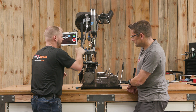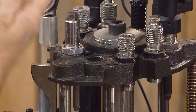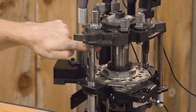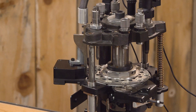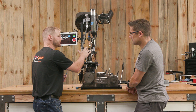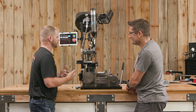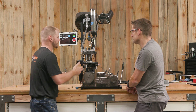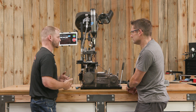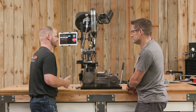So I'm going to run the pin down just a hair — a little goes a long way — about a half turn. This pin pushes on the rocker, actuating the priming: the pin attaches to the tool head, the tool head comes down, the pin goes through the shell plate, hits the rocker, the rocker rocks, pushes the primer punch up, and seats the primer. The reason you don't want to go too far is you don't want to shove a primer all the way in and damage the primer or your case. And if you have it way too low, you can cause the rocker to bottom out on the extrusion — there's no reason to do that, and if you're a little overzealous, bad things can happen.